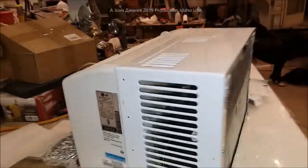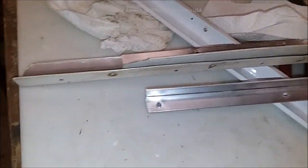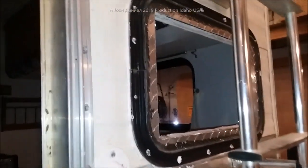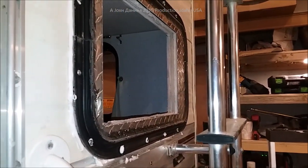Out here on the air conditioner, you're going to notice why it's so important that the AC unit doesn't have vents running inward and why this design is so great — so much space to work with putting it through the wall. Here are my brackets and angle pieces. The mount has two types of foam: a sound-deadening density foam and an insulation foam, both half-inch, plus a half-inch of plywood. That's a grand total of about one and three-quarters of an inch for it to mount into.